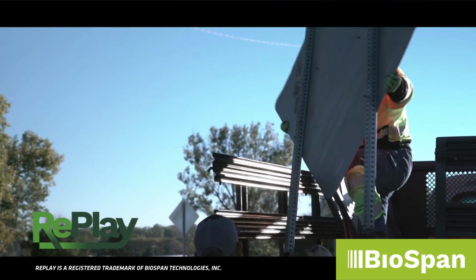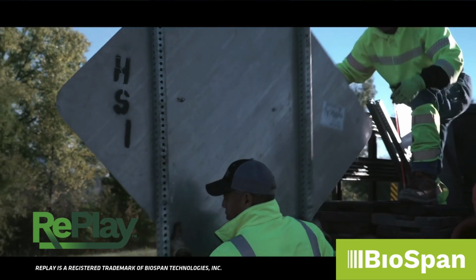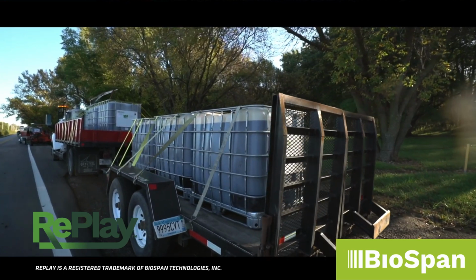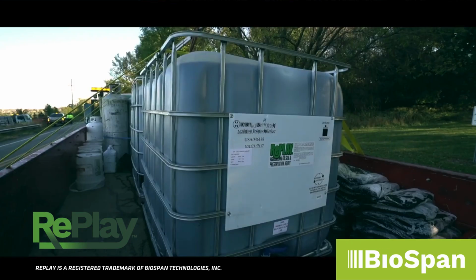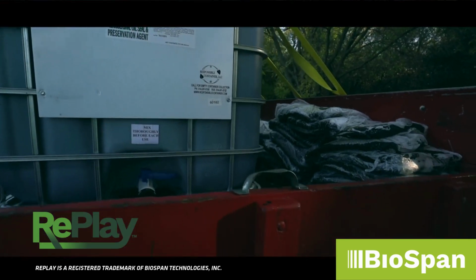And what about the benefits? The research suggests it could extend pavement life by 2 to 3 times. Seriously? Reduce cracking and raveling, and even create a more water-resistant surface. Wow. And what about the application process? It cures quickly, has minimal odor, and doesn't require sand blotting like those traditional sealers.